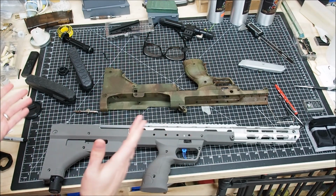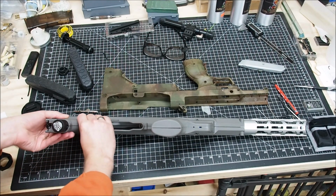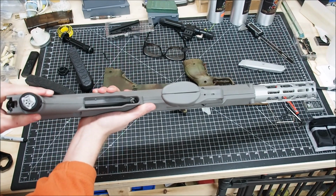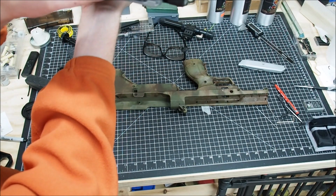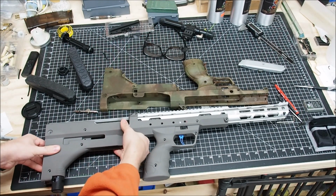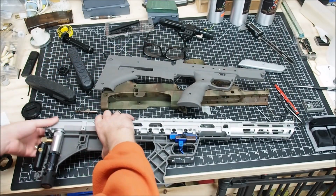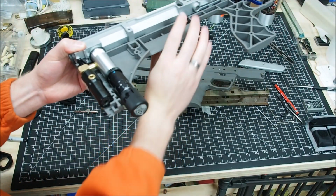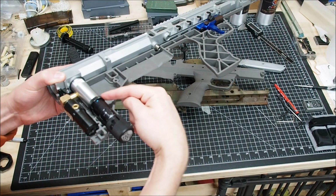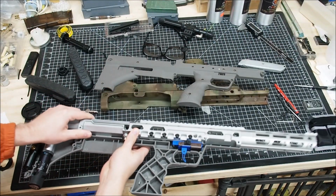So this is definitely a lot of trial and error. I kept going back and forth, setting the body halves back together around it, squeezing it together, looking from the backside, looking from as many angles as I could to get an idea of where things may have been binding, and then I'd remove one side. Then look around on the one side to find, oh yeah, it's in here by this knurled nut that I need to remove some more material.